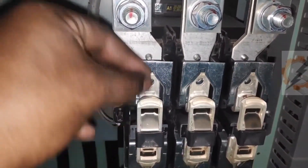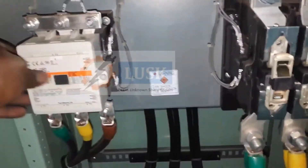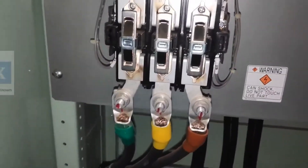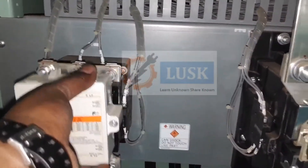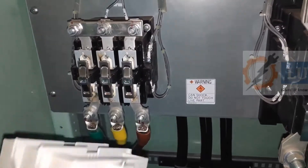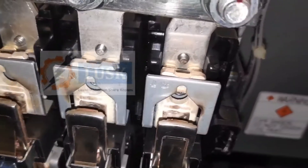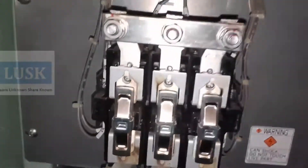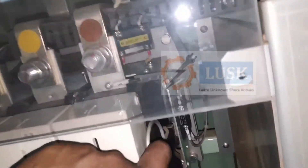This will slowly cause damage to the contactor and motor. If we are not cleaning this properly, what will happen one day in future without proper maintenance is that one or two out of three contactors, when starting the motor, will get latched and will not come out when you are switching off. At that point there is a high possibility of single phasing, and when single phasing happens either the motor will burn or the contactors will burn. So regular maintenance is compulsory.